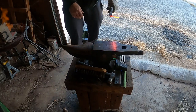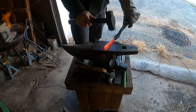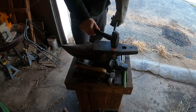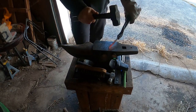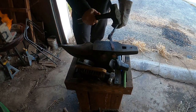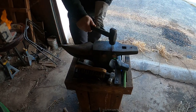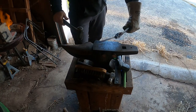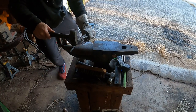All right, so now that it's heated back up, we got to pull it back out to straighten out the back edges again and make sure that everything sticks to right around a half inch wide, is what we're going for. So we're going to hit it, try to get it around that half inch, take the waves out, then we're going to lay it onto its side and strike it again to keep everything flat, because when you hit it down, you can create a wave inside the stock that, like I said earlier, is not something we want in a knife, but great for bonsai.